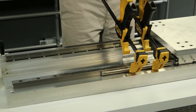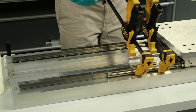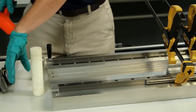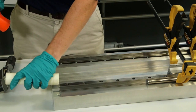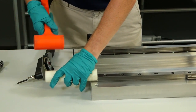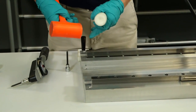Next, I want to make sure that there are no gaps between the rail in this direction. How I'm going to do that is to take my mallet and just lightly tap it on both ends to ensure that the rails are as snug as possible. Don't hit it too hard or the rails will actually hit one another and ricochet back and you'll actually get a larger gap.